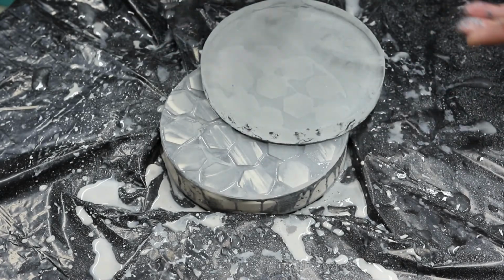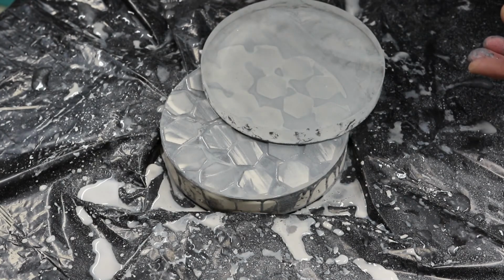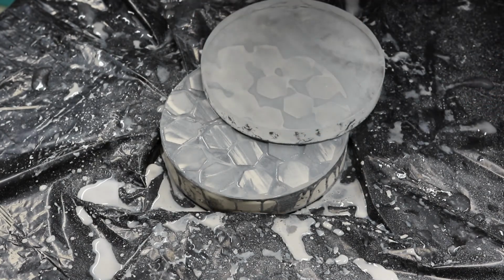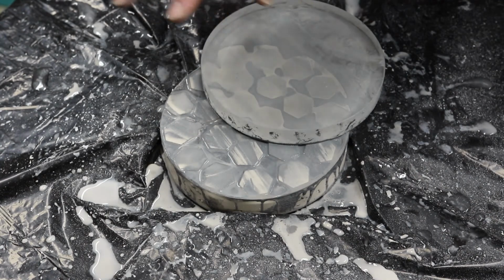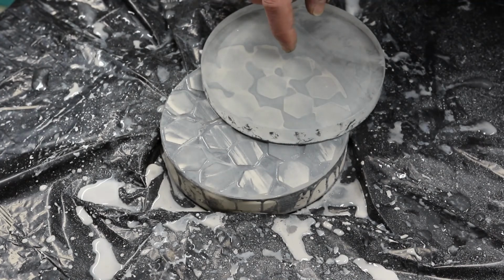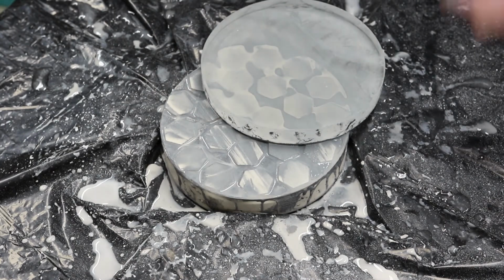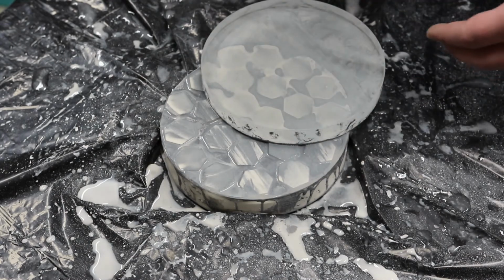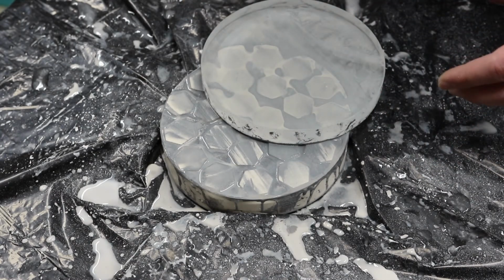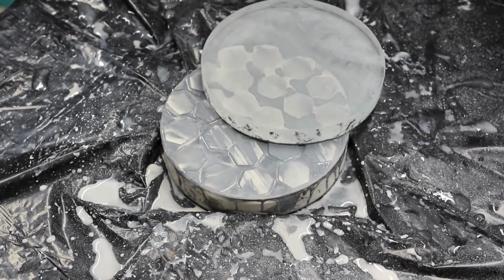And I think something that I'm not doing correctly here, and I'll have to get clarification on this when I share my update on Cloudy Nights, but I think instead of paying as much attention about going around the barrel, I need to be paying more attention to how many times the mirror rotates around towards me. And that'll make sure that I'm actually getting an even distribution of grinding on the mirror, rather than worrying about walking around the barrel specifically at a certain number of times.